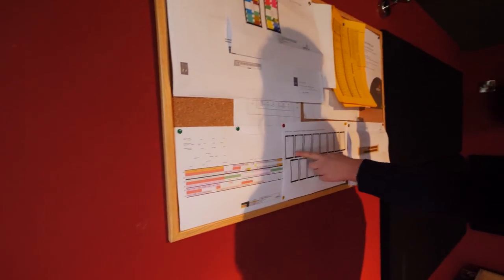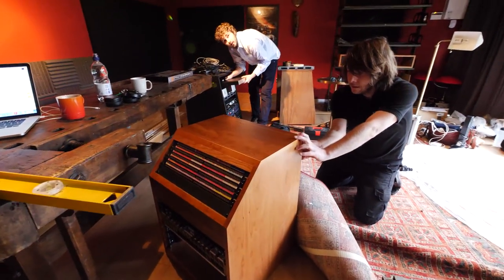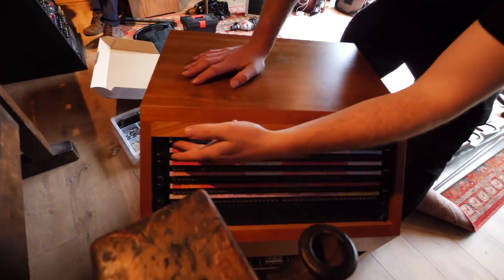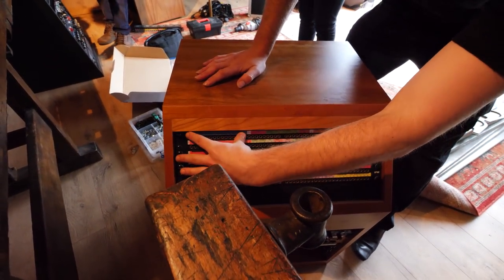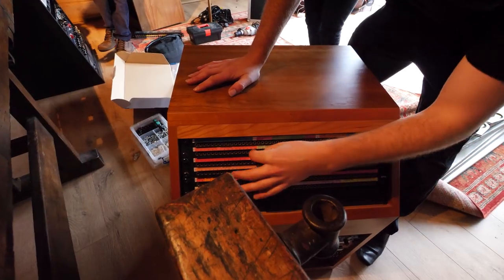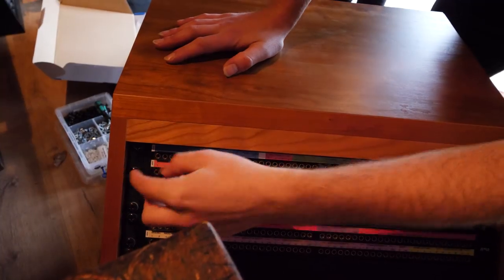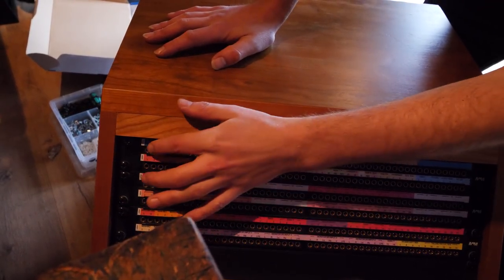This here correlates to the cables and the EDAC panel. Is it what's called normalised? So what you're going to have is your output signals a lot of the time on the top row, and underneath them you've got inputs to other pieces of equipment. For example, this blue block will be all your synths in a bank over there, and underneath is where they go. In this case they'll be half-normal — so this hole here is joined behind to that hole there.